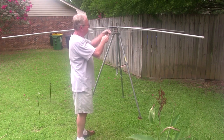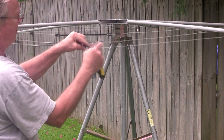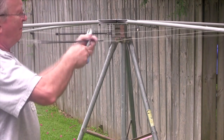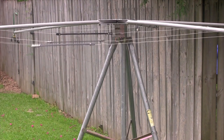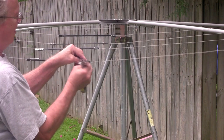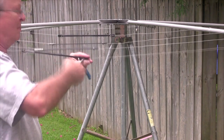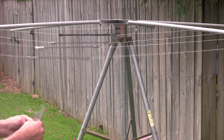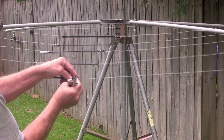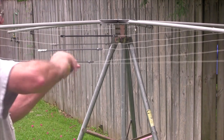So I'm putting together the Cobweb antenna there. Tommy used that this year. That's basically a bunch of halfwave dipoles put on a frame. It's not a directional antenna. It's dipole, so it's omnidirectional. A lot of bands. It starts at 20 meters and goes on up. Did it go through 6 or was it just 10? I don't remember. It did 6, but my tuner didn't. Yeah, that's right. So it needs to be tuned a little bit on 6.